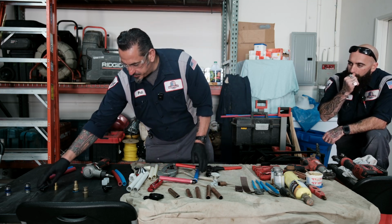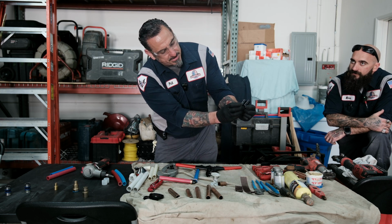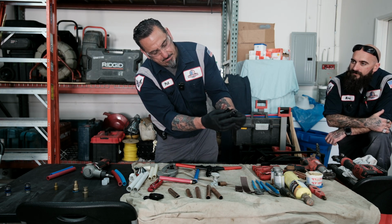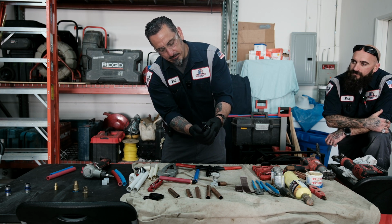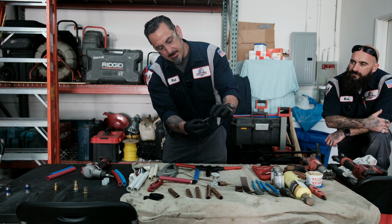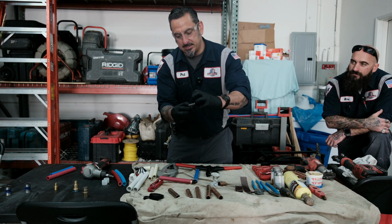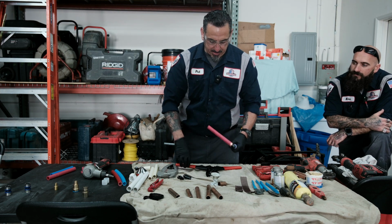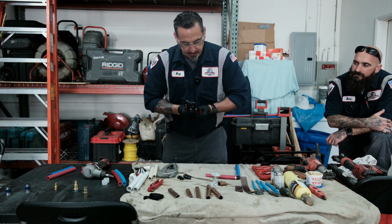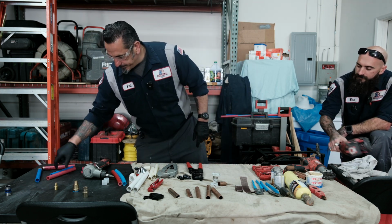The one important thing that you need to know about the crimping and the expanding pipe is the fittings are different. It's very important to know that the crimping fitting has the identifying 3 ribs, as the expander has like the crown rib that you can see when it starts expanding, it'll grab, and I'll show you that one. But let me show you another type of crimping process that is really a lot better and something a lot of people may prefer.